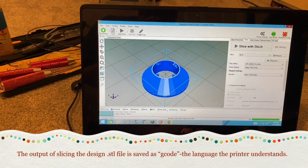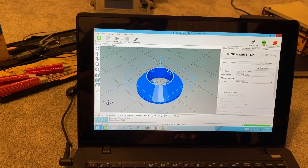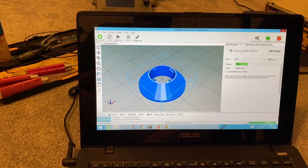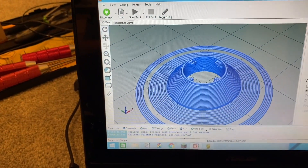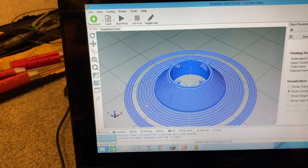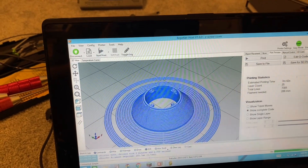I've got my printer set up, settings and extruder — that's the part that melts the plastic. And I'm going to slice it. You'll see it's doing the math and then it's converted it into layers. And because I don't have a heated bed on this old printer, I'm using a little trick called a brim, which will break away but will sort of glue it down to the print surface really well so that the part won't warp at all. And now I'm going to hit the print button.